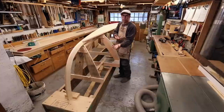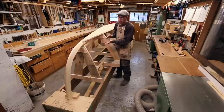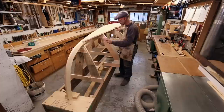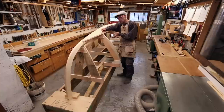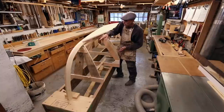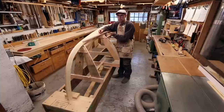But there's another thing that batten allows us to do. It allows us to leave one edge of that planking rough. So I can cut it, say, an eighth of an inch larger than that line or something like that. That means I only have to focus on getting one of my plank lines looking really good. I can put it up on the boat, I can glue it in place. And the way I deal with the other plank line, the rough edge, is we take a router with a template bit or a flush trim bit, and we just run that right on the face of the plank. The bearing on it follows the rib band and it cuts that plank down to that finished shape. So that's the savings right there, both not having to pre-shape that edge, and when you do shape it, the router's taking care of that job.